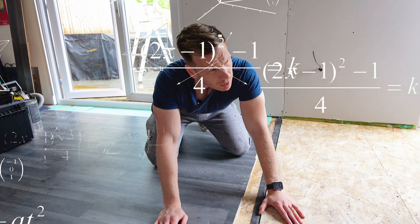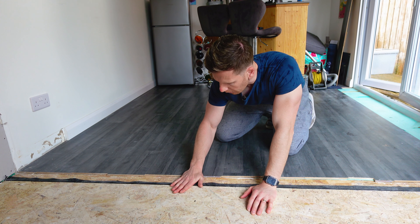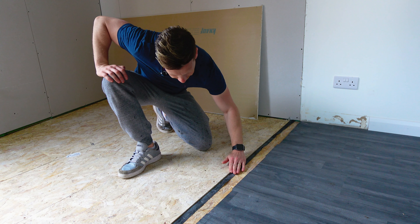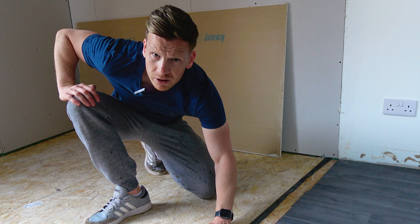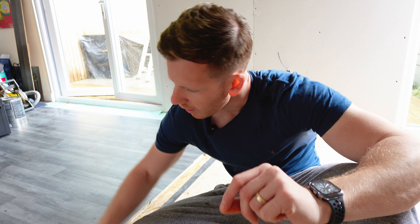I think most likely is that I've got two slightly different floorboards — this was an 18mm, this could possibly be 12mm, which is why there's a 6mm gap. Anyway, there's a discrepancy. So if we're going to lay this new flooring down, this needs to be level and flush. If there's a bit of a lip here there's going to be a springiness to this, and we all know this is going to be the dancefloor. What we don't want when we're busy cutting out shapes is a springy dancefloor. So I'm going to get a planer and feather out this floorboard to give a smaller gradient across here, and when I lay the flooring with the underlay underneath — which is going to add probably another 2 or 3mm — we'll get a smooth transition from one floor to the other.